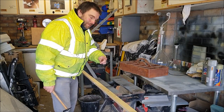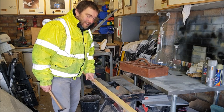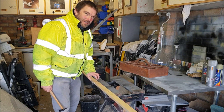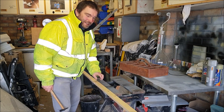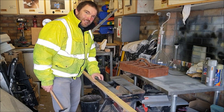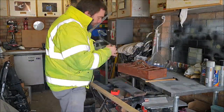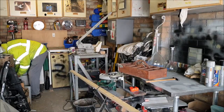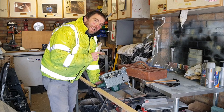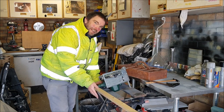Now, what I'm going to do is use my skill saw to make that groove in the wood. Of course, I can't have any clamps or anything beyond that edge that's going to interfere with the guide. So what I'm going to do is just pin each bit of wood very slightly to the workmate, just to hold it while I make those cuts. You'll see what I mean. Right, so I've set the saw up to make a 6mm cut, 10mm from the edge of the timber.